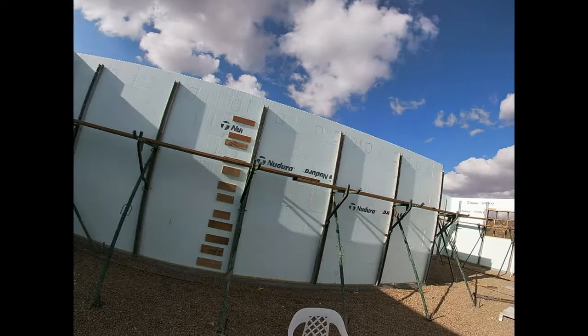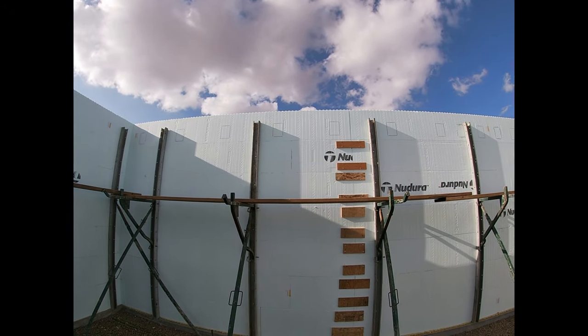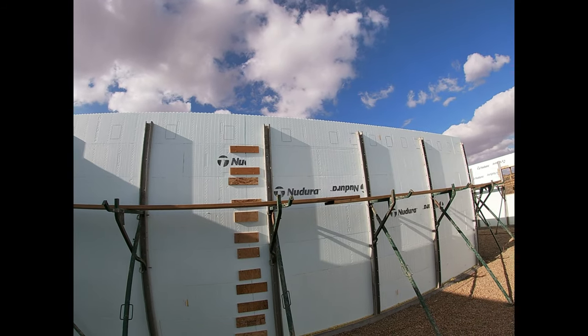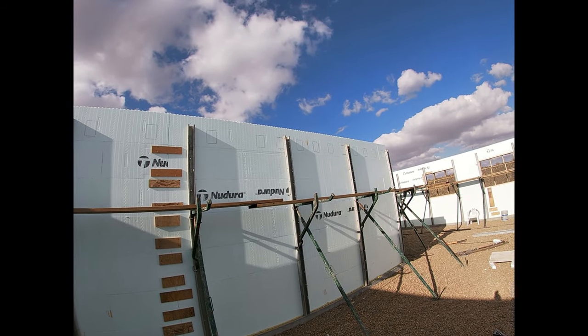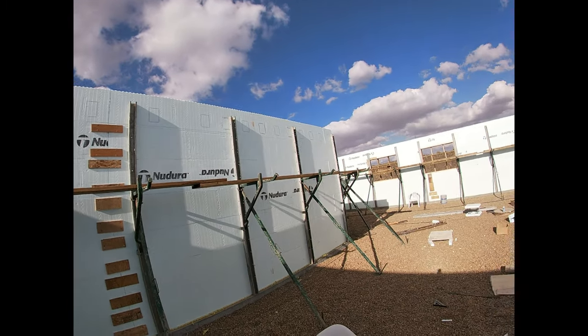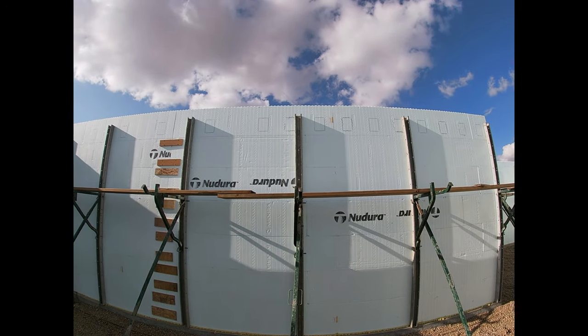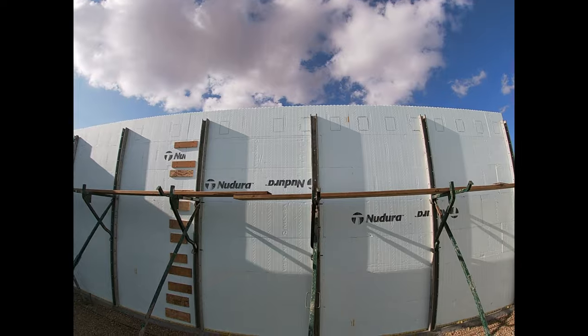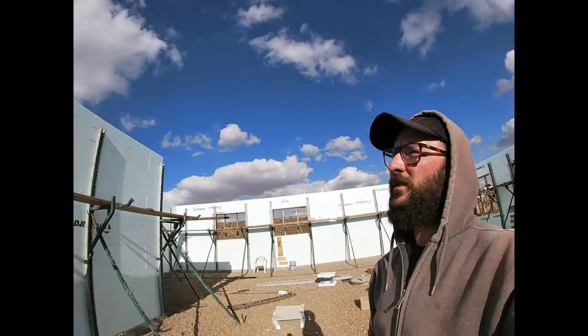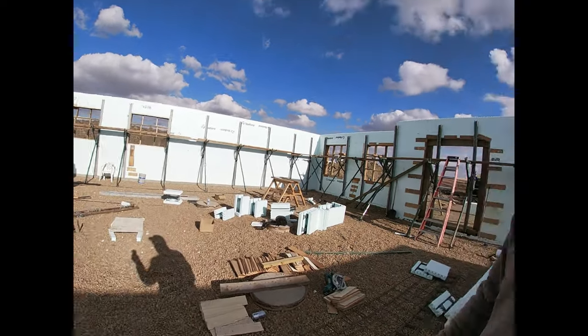So we've got these cutouts laid out here now. You can kind of see on the wall there. Every 32 inches we've got a cutout. And wherever you see a little rectangle there, those ones didn't work out. I started to hit braces, so I measured from the other direction. And then it worked out better. But you can see the squiggly ones, those won't get cut out, but the rest will. And that is where we're gonna bolt that double layer 2x10. And that will hold up this side of the floor truss. The other side will be held on the beam that sits on these piles.